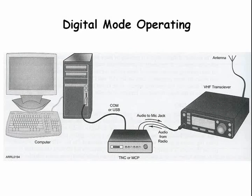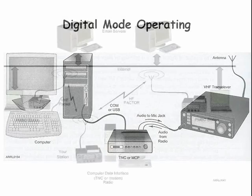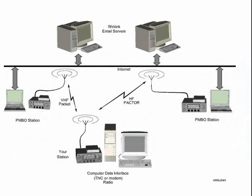Digital modes such as radio teletype, PSK31, computer-based CW, and many other modes require an interface box between your computer and your transceiver. Another popular digital mode for DX is DX via the internet, known as EchoLink. The internet is used to link together repeaters around the world. You select which repeater you want to be hooked up to worldwide, and from there you can have a QSO with someone who can access the internet.